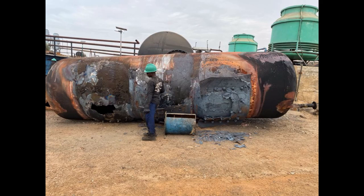These burners are going to heat the air up very hot, far hotter than a regular burner can, and instead of having that direct flame impingement causing the damage that we see here in the photograph, you're going to have a more spread-out, even high-temperature heating, kind of like in an oven or a kiln.